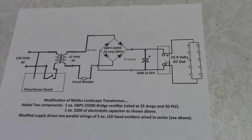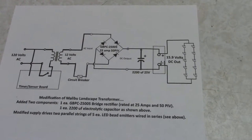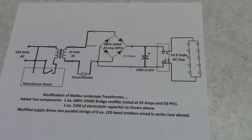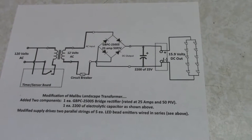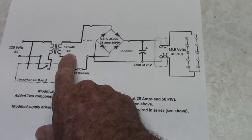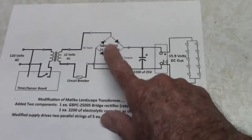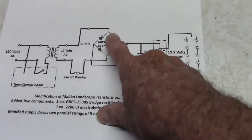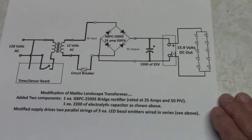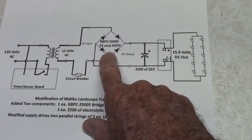This is a look at my Malibu system — a Malibu low voltage transformer — and the bulk of my system is made up of that. What I did was modify the Malibu by rectifying the AC that came out of it. It was a 12 volt AC system. 120 volts comes in one side through a step-down transformer and comes out at 12 volts AC. Because I wanted to use LEDs, I knew I wanted to rectify this into DC. That's done with a full wave or bridge rectifier — there's a part number on the schematic for you.